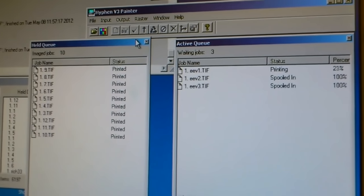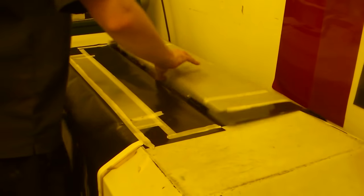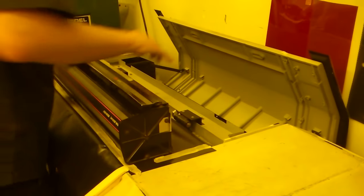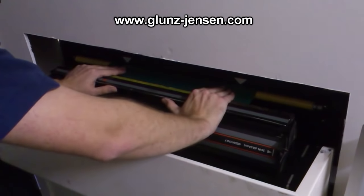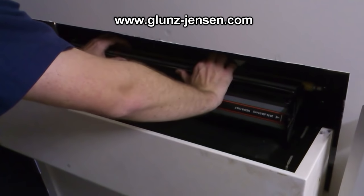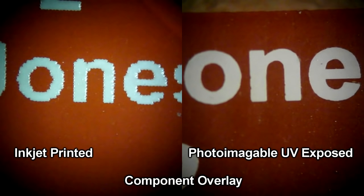The first step is to actually process the Gerber and drill files that you give them. There are various ways they do this depending on what software and machines they use. We'll go straight to generating the film. What you see here is the film printing machine — this is the film for all the photo-imageable processes: the copper layers top and bottom, and top and bottom silkscreen as well. The manufacturer may use an inkjet type silkscreen. Silkscreen is an old terminology from when they actually used a silkscreen process; I don't think anyone uses that anymore. Inkjets are very popular now, as they can direct print onto PCBs.